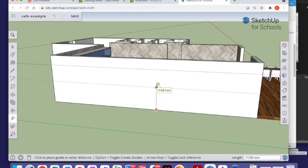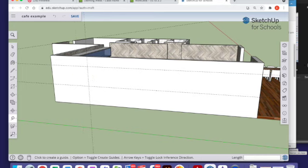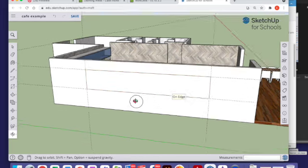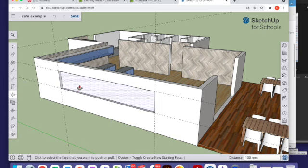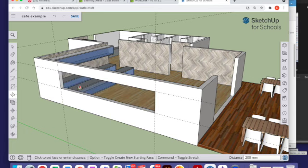I'm going to place one on this wall. It's going to be a long, skinny, modern window. I'm using my measuring tape to mark in the measurements for it. Thinking about your window placement is a really important factor of building design. So the first thing you do is you put in your guides and then you draw a rectangle. We're going to push that rectangle through, and using the push-pull tool, we are going to type in the actual width of the wall, which is 200 mil. And that should go through and disappear because we've pushed it through the width of the wall.